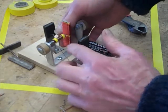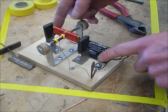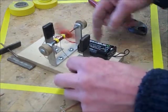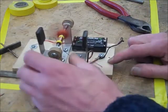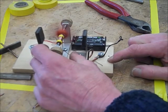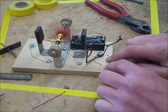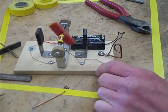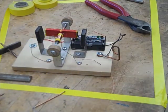I want the split between the commutator segments to reach the brush right about the time the end of the armature gets to one of the magnets. When I turn it on it rotates fine, and if I give a little more pressure on my brushes it goes a little faster. WD-40 on there actually improves the electrical conductivity. This motor is now ready to go into a car.